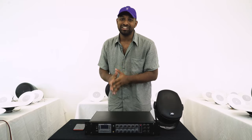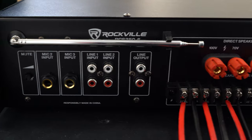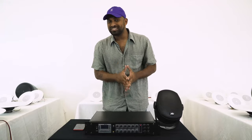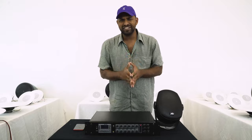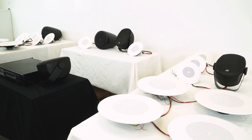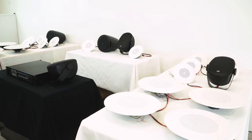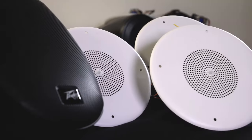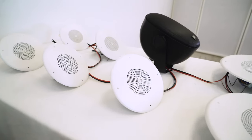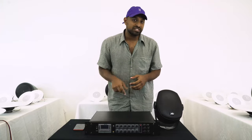Hopefully that demo showed you how easy it is to use 70 volt systems. I had each zone routed to a zone on the back of my amplifier and was able to control them independently. From this video you should have learned a lot about 70 volt — how easy it is to use and all of its advantages over 8 ohm and 4 ohm speakers. It is the number one application for large speaker installs, and it's very easy to do yourself — you don't have to pay a contractor a high install fee. If you are looking to run multiple speakers over large areas in your commercial or personal spaces, I highly suggest you check out 70 volt amplifiers and speakers. Leave a like and a comment below — I'm Mike from Rockville, see you next time.